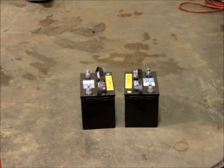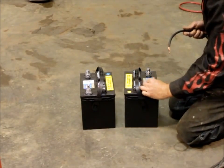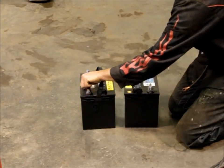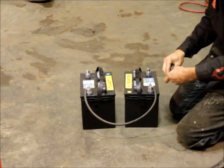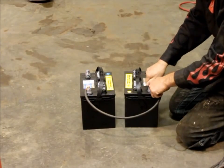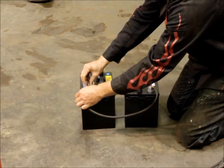To set this up you're going to want to disconnect the batteries from both vehicles. You don't want the voltage spikes that go along with welding going through your vehicle's electrical system — microelectronics and computers definitely don't like that. So once you've got the batteries disconnected, you need to wire them in series so you can get your 24 volts. I've got my battery cable here and all I do is connect that from the positive terminal of one battery to the negative terminal of the other one. You definitely want to make sure that your connections are tight, because you're going to be passing potentially a couple of hundred amps through this, and a loose connection will melt down your battery terminals, possibly damage your battery and the cable, and it may start a fire as well.